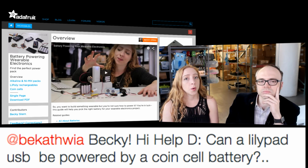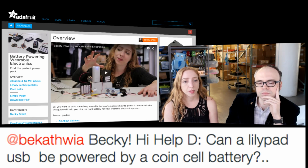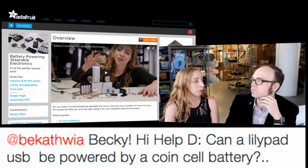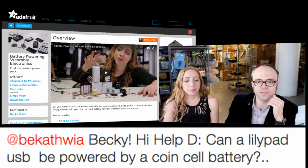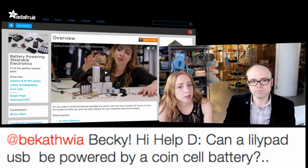So no, a coin cell is not going to power a LilyPad USB or a Flora. The 2 coin cell pack that we carry, a 6-volt pack, will power a Gemma and 4 NeoPixels for 2 hours or something. I recommend a LiPoly or an alkaline pack for those, not so much the lithium coin cells.